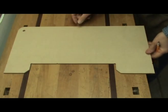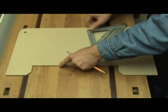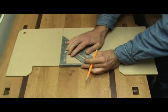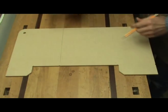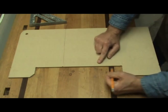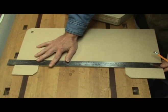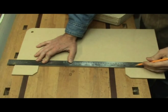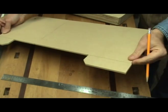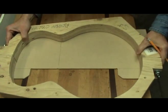With the template blank, you'll notice there are some notched areas — this is for the waist. There's a notch here and a notch there. I'm going to run that line down like that — that's nine and a quarter inches from one edge and four and a quarter inches from the other edge. This is also the center line of the guitar. I'll place a line going the other way as well, which makes it easier to see where the center line is. There are also little notches out on the ends of the template blank to help you reference that.